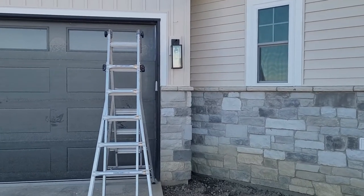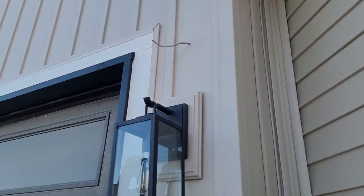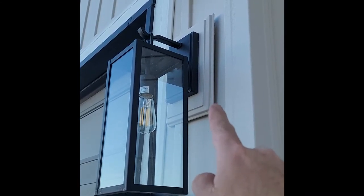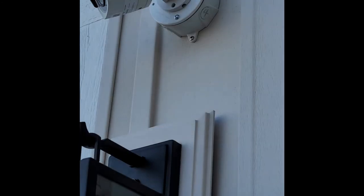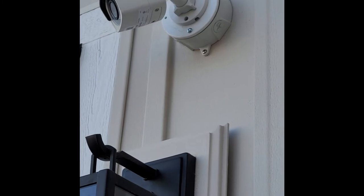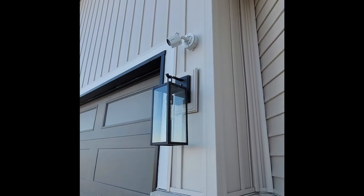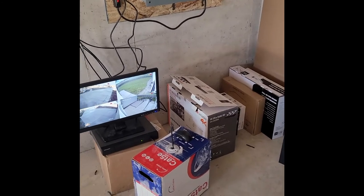There were several mistakes made — one of them was where we pre-wired the cameras. For the cameras, what happened is they were supposed to be trimmed out with the back boxes on there, but they weren't. They just drilled a very small hole and poked the wire through. Unfortunately I had to put an outside can on there and mount the camera to the can in order to fit the splice inside it. In the bigger picture it looks fine, it's not very noticeable — I just would have preferred they had trimmed out for the cameras the way they did for the electric.